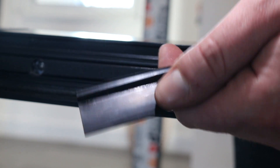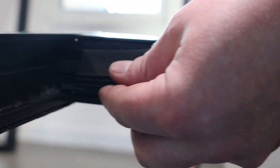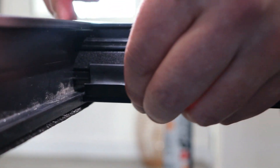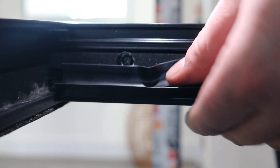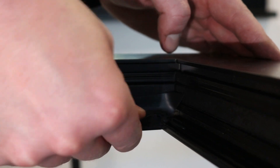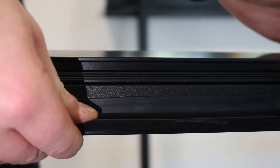This is your cap tip gasket with a flap on the bottom. When putting it in, the flap must bend round as shown. When you meet the corner, cut at 45 degrees and push into place. You can now bead the sash — top and bottom first, then the side. There is no bead in the interlock side.